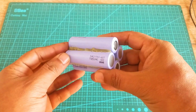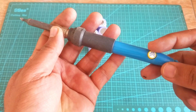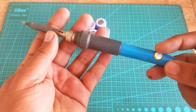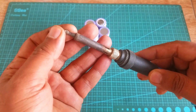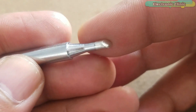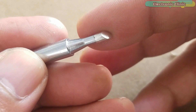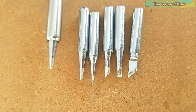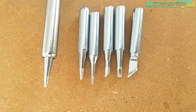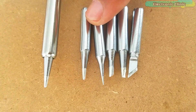Next, we are going to connect all four cells in series. I set my soldering iron temperature at 400°C. For this soldering job, I am using a bevel or C-series tip. Due to its large, slightly curved surface, it can hold more solder than most other tips and it can transfer more heat. I have a very detailed video on how to use different soldering iron tips — I will provide a link in the description.